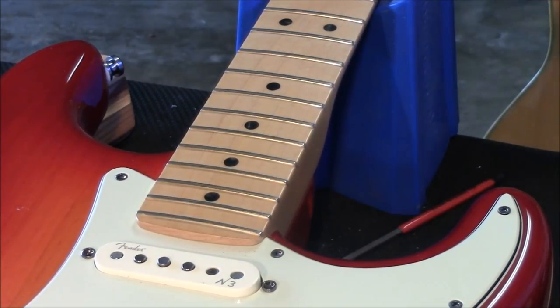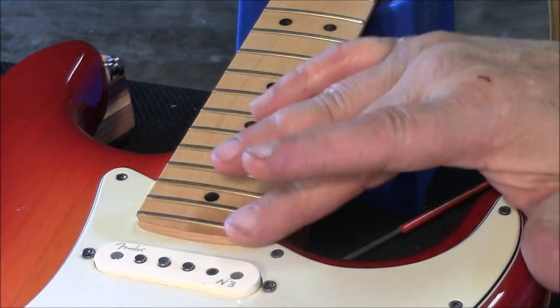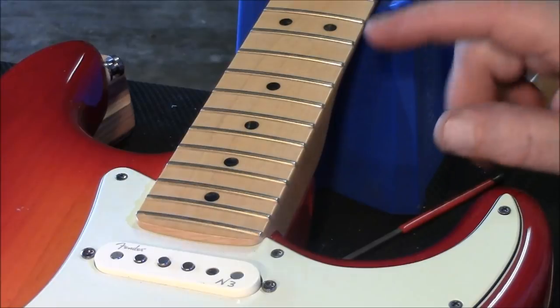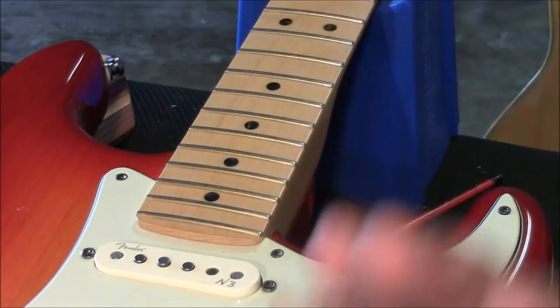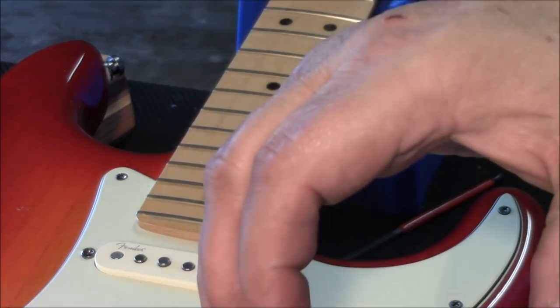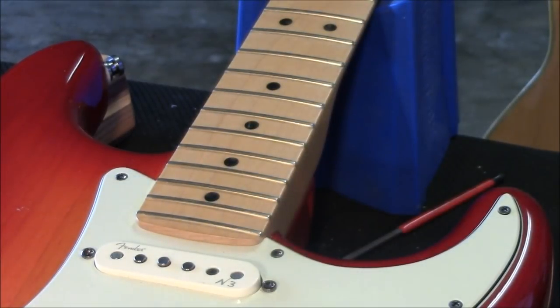But then comes the fun part. You'll feel the tops of these. They're still sharp as sons of guns, and they're, what's the word for it, like grating. So I have to actually take that nice smooth 35 degree angle, like it's kind of like this, and roll it backwards so that the string doesn't catch, you know? Oh man. And then smooth up the fret.